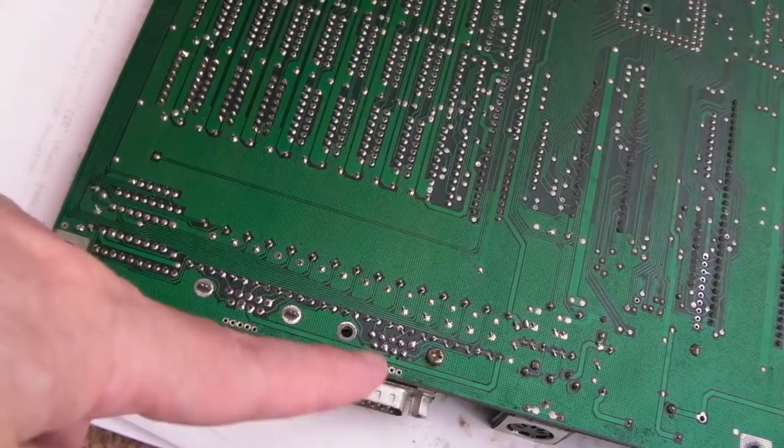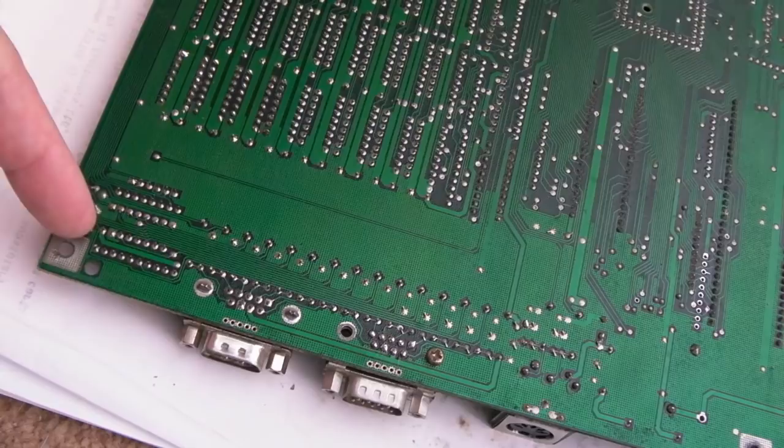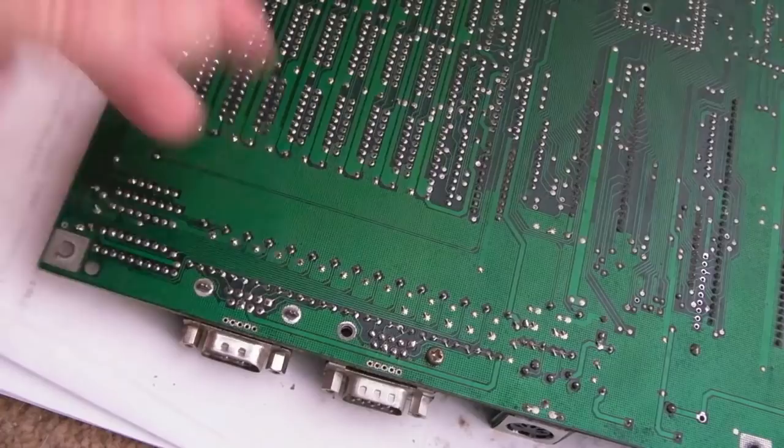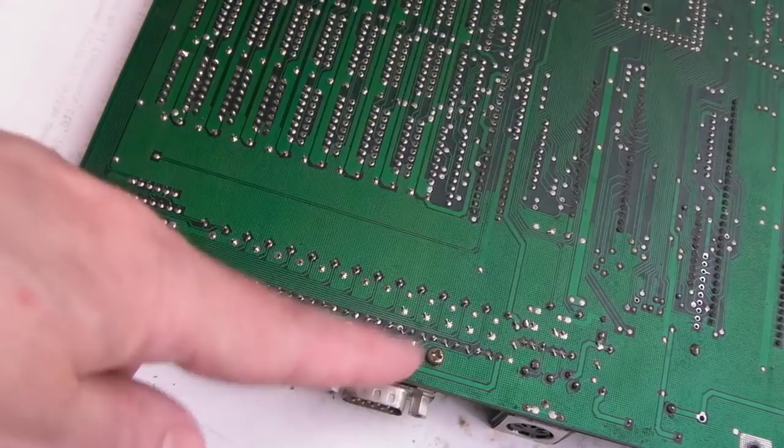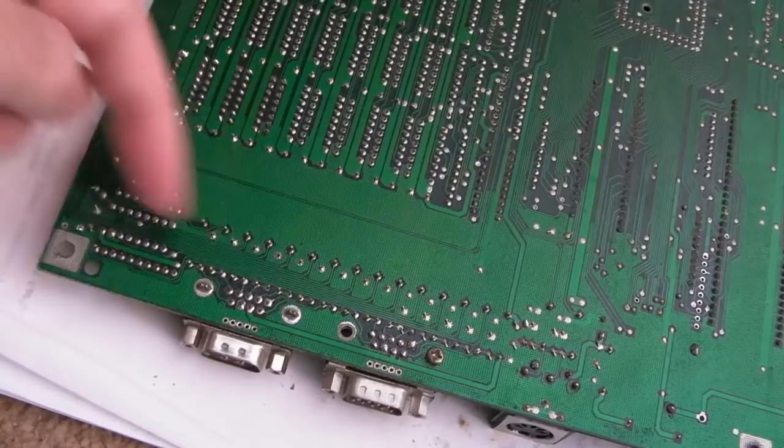Yeah, it's no surprise that when I cleaned around these things with the vinegar, this is when it went absolutely crazy. It went from just occasionally registering on its own, every now and again, to, you know, all out, can't control the mouse at all. And then in the tests, you know, all sorts of, the two ports conflicting with each other. You move something on one, the other one's going crazy. So it could be some bad conductivity here. The traces could be damaged on the top side, maybe. I don't think so, though, because there are very few traces on the top side. The things come on the bottom side here. There's very little routing on the top side in relation to this stuff. But there is over here, I think, with these. So it could be that there's two issues here.